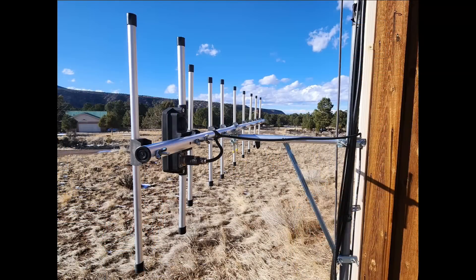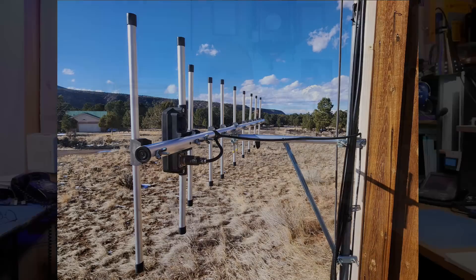The one I have out here — there were no screws to put in. The thing unfolded and you fold out the clamp; the clamp has a little hook to go over an existing screw and they give you a tightening nut. So it's very easy to put up. Use a splitter — even if you've got a dual band antenna, the part of the antenna that works on 440 will look like a very high impedance to 2 meters, so it won't use it very much. And the other way around too: a 440 antenna will look like an open circuit to 2 meters.